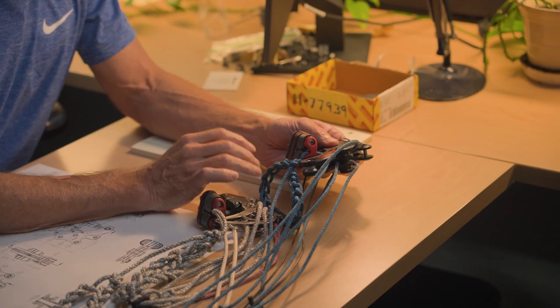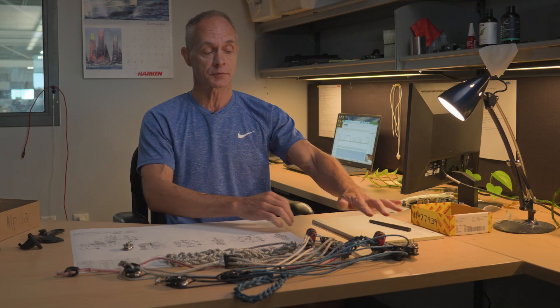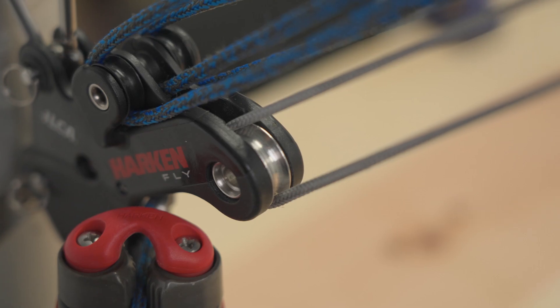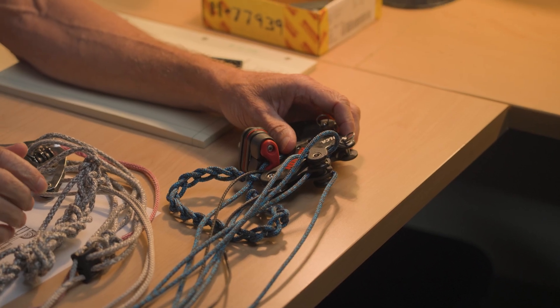What we really wanted to focus on with the new unit was reducing friction, so we concentrated on the most highly loaded sheave on the product. This includes the upper block, which is the main sheave leading out from the lower unit here on the arm. In the course of designing this product we came up with a new 25 millimeter fly sheave that we put in the lower unit and the upper unit to replace the smaller sheave that was in the old unit. The old sheave is aluminum running on a composite bushing. The new sheave is all stainless ball bearings — inner race, outer race, full complement dual row of balls — to reduce friction and take the load.